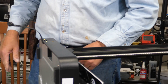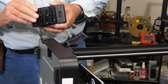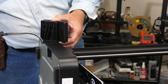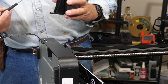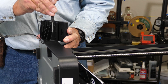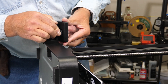It's up on its side right here. I'm going to put the display on - it's got a little plastic protector to peel off. It mounts with three holes right here on top. This cable will plug in up here. Find the screws for that - there's a package with three screws. Those are also M2.5. There's a little detent as you go to put that in there that kind of squares it up for you. We'll plug this in - it's got a key on it so it only goes in one way. Don't force these. If you ever bend the pins, you'll have a heck of a time getting them straightened out.